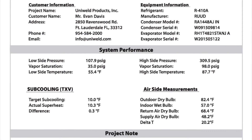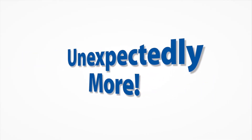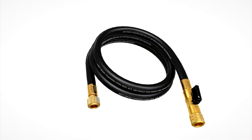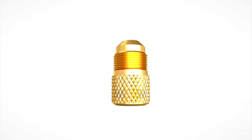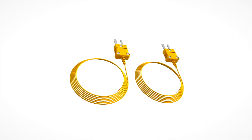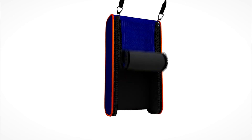In addition to amazing functionality, the SmartTek wireless digital manifold bundle is unexpectedly more. Along with the digital manifold, the bundle includes a 5-foot red easy turn hose, a 5-foot blue easy turn hose with an easy access T-fitting built in for micron gauge connection, a 5-foot 3/8-inch hose for 3 times faster evacuation of the system, a 3/8-inch refrigerant tank adapter, 2 K-type pipe clamp thermocouples, 2 K-type bead probe thermocouples, and 10 Velcro straps for organized wire management.